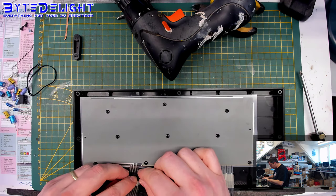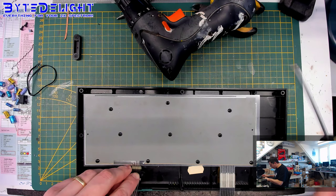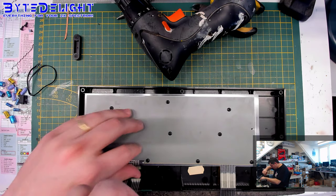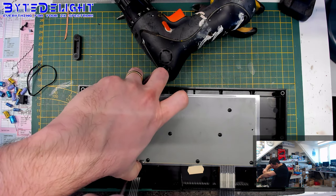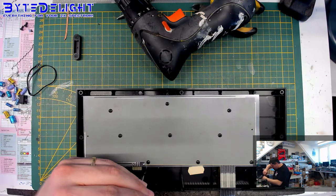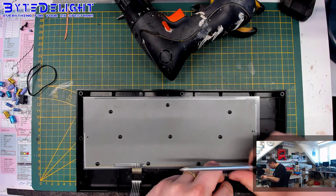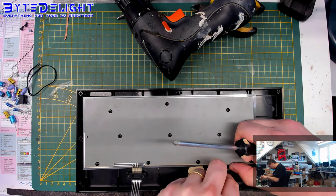Yeah, I do not use that much flux because flux is used for SMD components and not really for older through-hole components. I know some people do, even on through-hole. I don't think it's really needed. I just add some new solder instead of using flux. But I have some syringes with good quality flux.